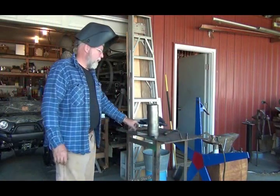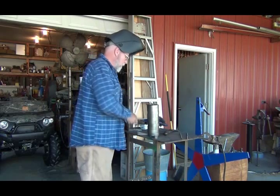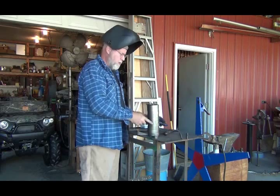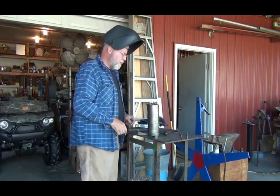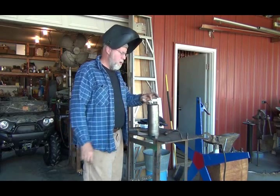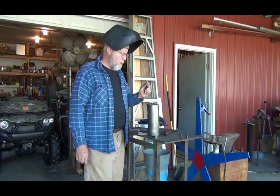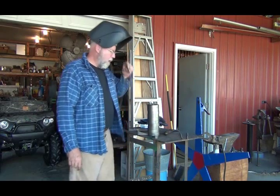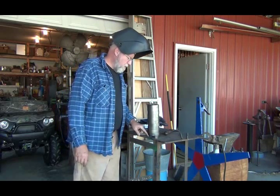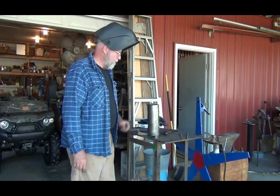I'm sorry, I'm not very good at working and trying to video. I've got both ends welded on with the rod going through the center of my little rollers. I used a piece of 1 3/4 wide, 1/4 inch thick flat bar stock, hot roll. And they're sticking up, you can see, about 3/8 or so above the rollers.